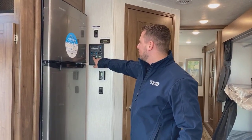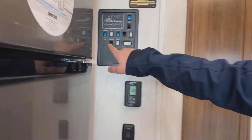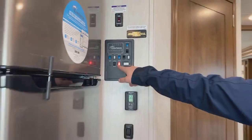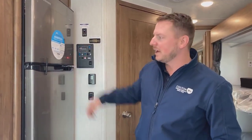We're going to press and hold our prime button, which is actually down towards stop, and then we're going to crank it over. The red light is on — that means the generator is turned on and running. Usually you'll wait about 30 seconds to a minute, and the microwave is our friend for an audible tone to hear if we have power.